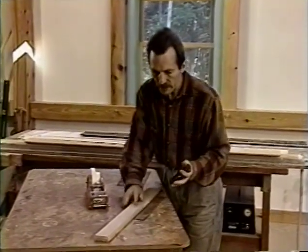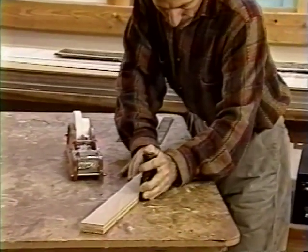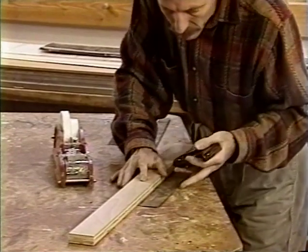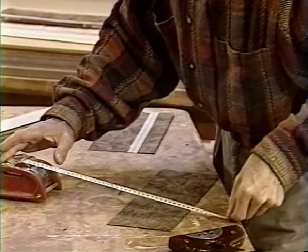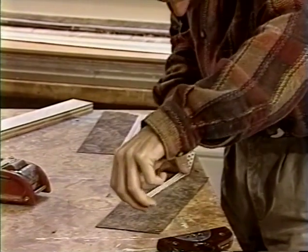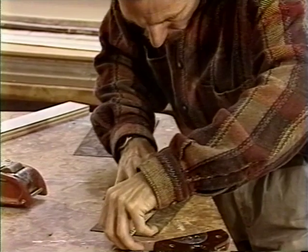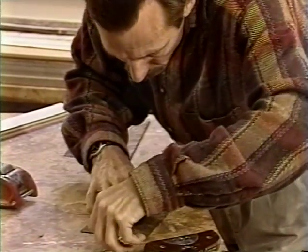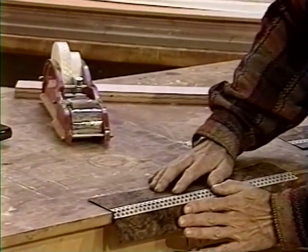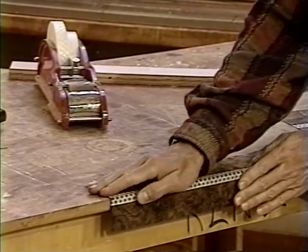Although I have the actual veneer already prepared, I would like to demonstrate how I did this on a sample. First, I'll make the cut where the veneer tape will go. Next, let me apply the 3-hole tape, like so. Now, there's one last thing that's very important for this to work properly. As soon as the tape is applied, you need to fold it like this while it's still damp. If you wait until the veneer tape dries to fold the veneer, the tape will break.